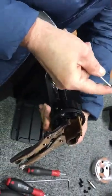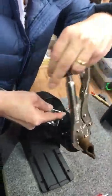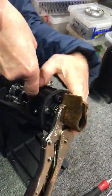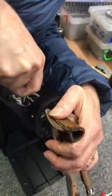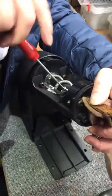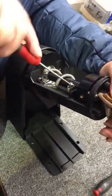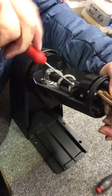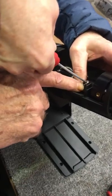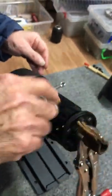Okay, she puts it there, and I stretch it up. You have that in your right hand, then you turn the auger, you turn that whole thing counterclockwise, and you get the screw in there. You have to make sure it's straight down into position. And you drive that all the way home. Okay, so you have to take your thumb and push the spring into position and tighten this all the way down. Make sure that that's all the way tight.